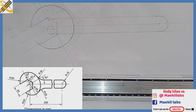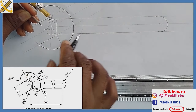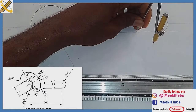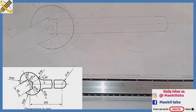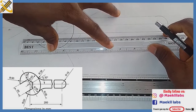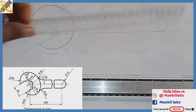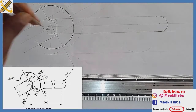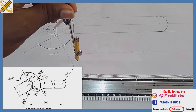Having gotten this area, we are told the arc joining this area to this area is radius 38. With your compass measure radius 38. On this mark here and this mark right here, strike radius 38 right there, then from anywhere on this area strike another radius 38 and draw a tangent. Radius 38 plus radius 38 is 76, so with your compass measure radius 76 mm. From the midpoint of the arc of radius 38, with radius 76, strike an arc.